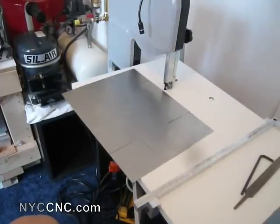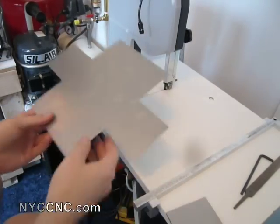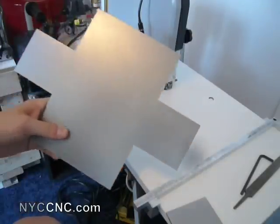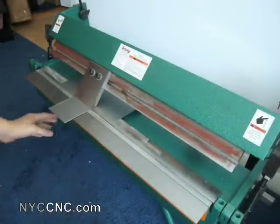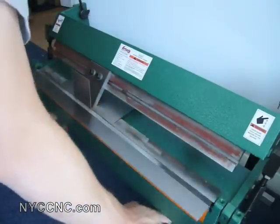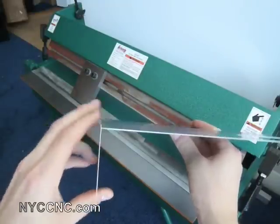The four corner pieces are out. Here's my original nine by twelve piece with four corners cut. Now I'm going to carefully make bends on my box and pan brake along those four edges. I noticed the finger is not parallel with the brake bar, so I moved it and it's now quite close to even — that's an important adjustment. I don't think they set this at the factory, so you want to make sure. I've locked down my piece, made the first bend to 90 degrees, and it looks good — pretty perpendicular. Moving on to the second bend.